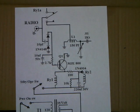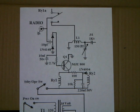A high gain tube, like a tetrode is, can have some anomalies, and sometimes it's referred to as hot switching. It means that the screen cannot be activated too soon after the antenna relays are closed and the drive is given. If that happens too quick, like say all at once, you can have an arc occur at the antenna relay because the tube is so fast at going into conduction.